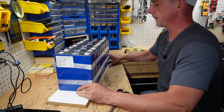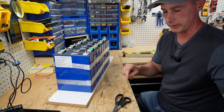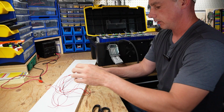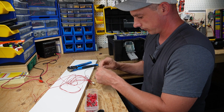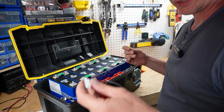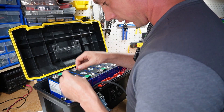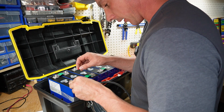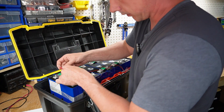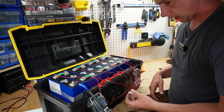We have a 24 volt battery — now I just need to put my bus bars on and my BMS. This is going to be my main negative on this side and my main positive on this side. That's a tight fit. I'm going to work on putting some ring terminals on this. I've got my balance cable all ring terminal'd — it can be a little intimidating, but basically you start with the first black and then move through the reds. I've got my first black going to the negative terminal. I'll connect the B-negative for the BMS and then put on the balance lead.